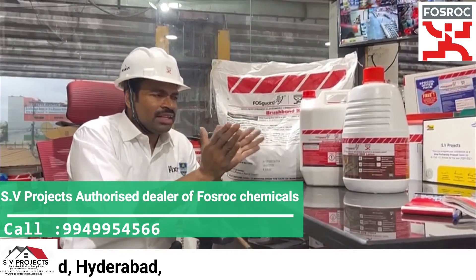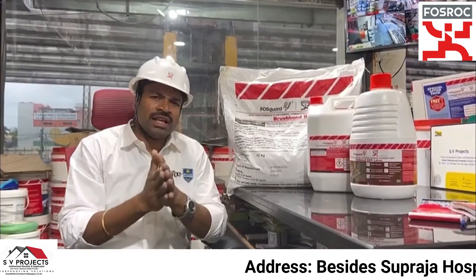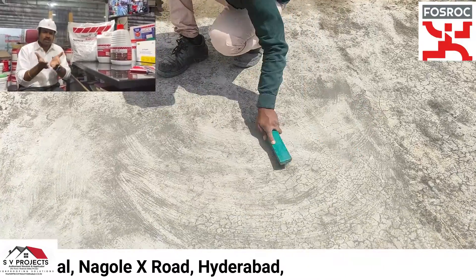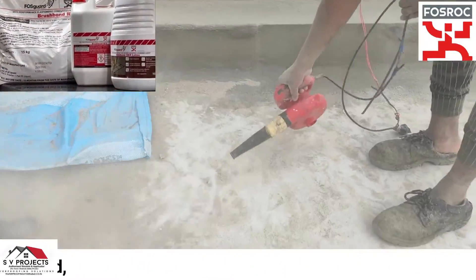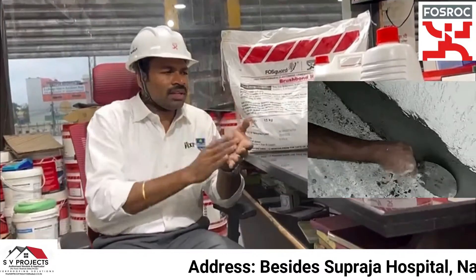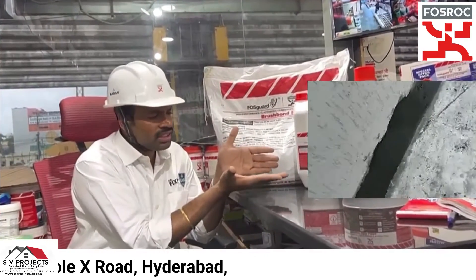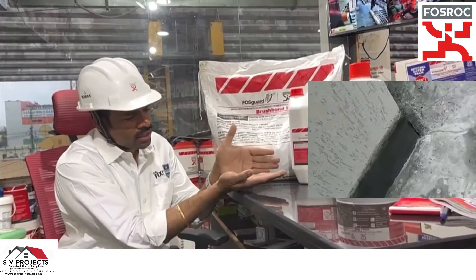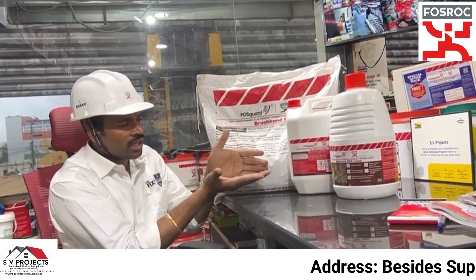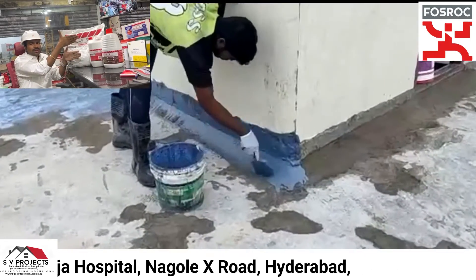After applying the taper at the corners, for the bathroom, slab, or RCC tank, surface preparation is very important. Use hacking hammers or chipping machines to clean the entire surface — bottom and sidewalls — remove all dead mortar, then wash and clean the surface completely. At 90-degree angles, it is a weak joint between two different surfaces — RCC and masonry brick wall — so we taper those joints to avoid any crack or gap possibilities in the coating.